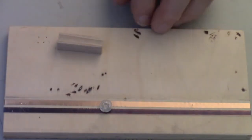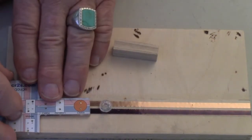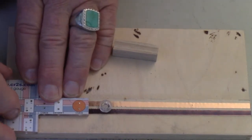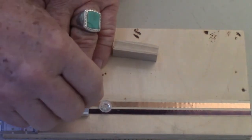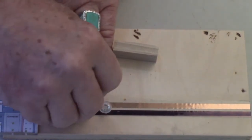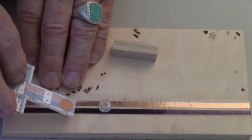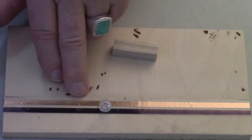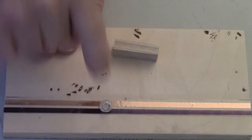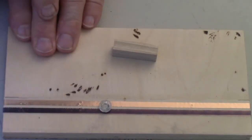The other way we could do that is I can come back and take our gauge and line that up so that it goes directly into the two strips on there, and then make my pinholes with the map pin. It lines it up so that we can then put the pins of our adapter in there and push it into the flat tape.